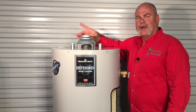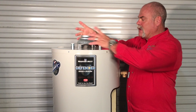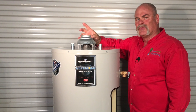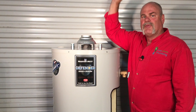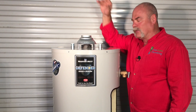On top of your water heater, you've got your flue pipe assembly — this is actually the chimney collar that attaches to the top of the water heater. Your type B vent, and actually inside the house you can still go single wall, but I like bringing type B vent all the way down. It's double wall, which keeps anybody from getting hurt or scalded if they touch it. It will go up, tie onto the vent, and go out the roof. Remember to have your one inch clearance anywhere that your type B vent pipe goes.